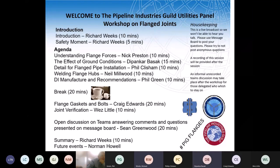But this is why I think it is very important also to understand that softer materials generate a lot less stress. Having a PE pipe flexing in the ground is probably a lot less problematic than having a steel pipe, because the stresses will be much higher. So I think some maths needs to be done before a decision on this is taken. It's not a straight answer.